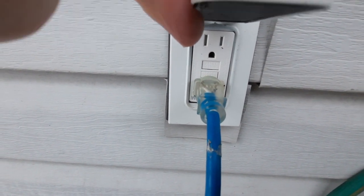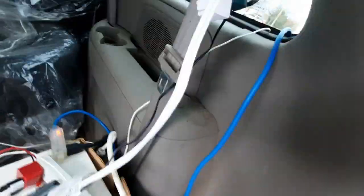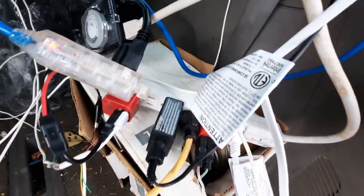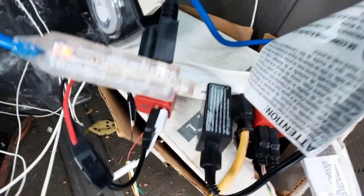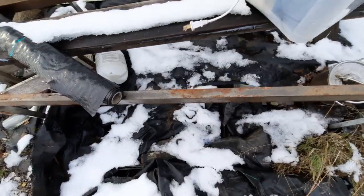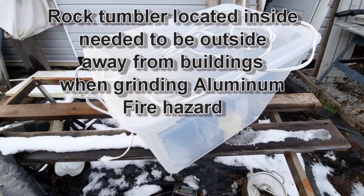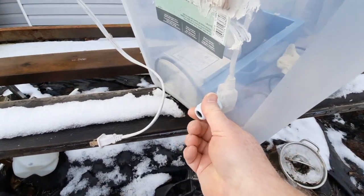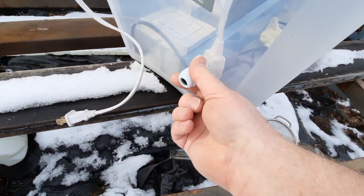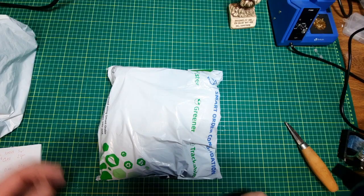Currently, this is my power distribution for my festive lights. Power cord comes in through the window, goes to a timer, goes to an octopus — a very nice octopus — with USB power adapters going out to all the wires, which then go out to all the lights. That will be replaced. Instead of using that, I'll be using a container — a lot smaller one — where I can mount the appropriate cable gland size for the power going in and out to all the lights. And that way it's nice and watertight.